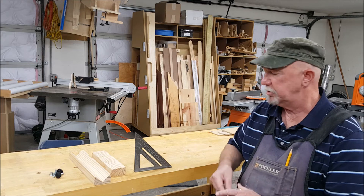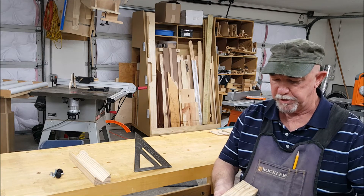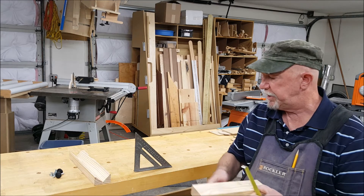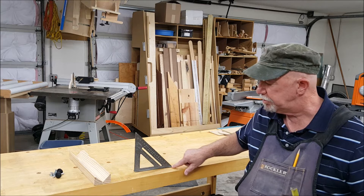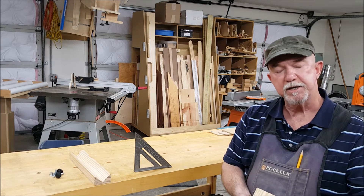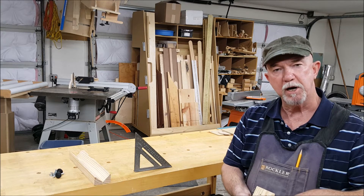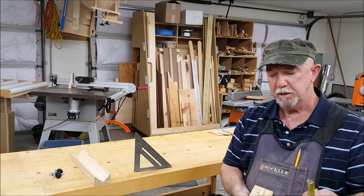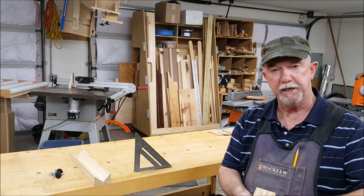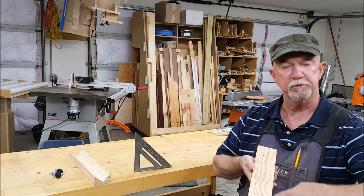So imagine you are going to cut a half-inch groove out of the middle of a board that measures two and a half inches across. If you're cutting a half-inch groove, then it's going to be a half inch from the point where the cut starts back to the point where it meets in the middle. Two and a half inches — half of that is an inch and a quarter, that's the middle. An inch and a quarter and you're doing a half-inch cut, so you should be able to take away a half inch, and what remains — three quarters of an inch — is the distance you should set your fence on the table saw from the emerging edge of the blade as it comes up out of the table, in order to have the point of the blade meet in the middle as you make first one cut and then the other corresponding cut.